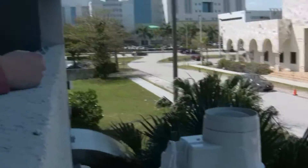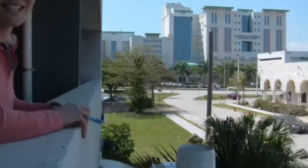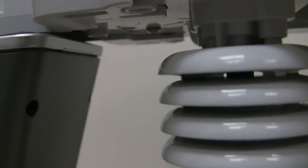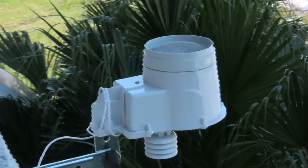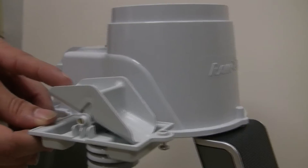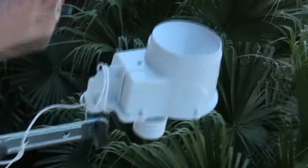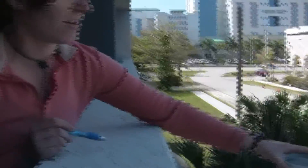This is the weather sensor for the ET controller that has been installed. The two parts: down here is the temperature sensor, which has a shield so it doesn't get affected by solar radiation. The body of the unit is the rain sensor — it has a tipping bucket inside. Each time one side of the bucket fills up, it tips and counts a certain depth of water, and it keeps tipping until the rain stops. On top there's a screen that can be removed to protect from debris. A good idea if these are mounted up high is to apply plastic spikes around the edge so birds do not want to land on it and make a home.